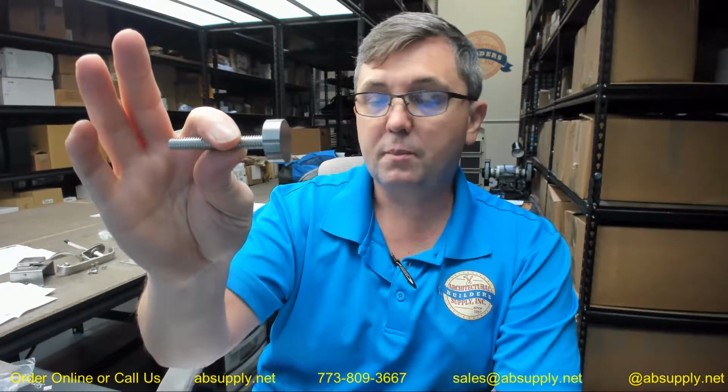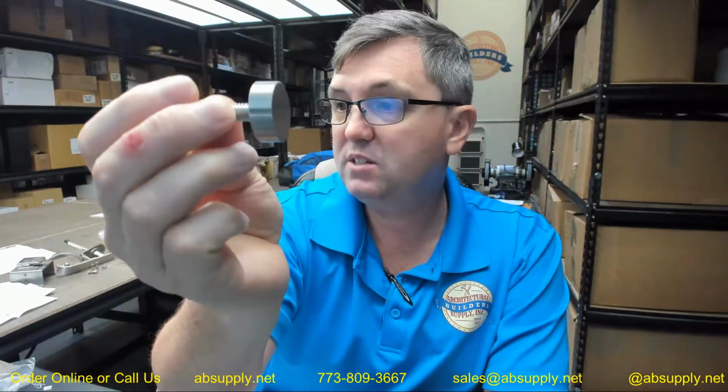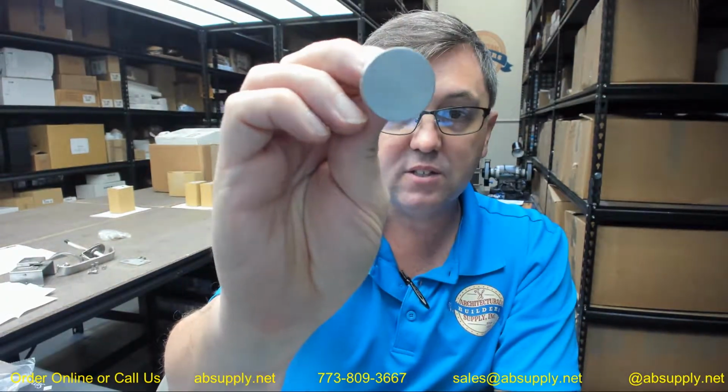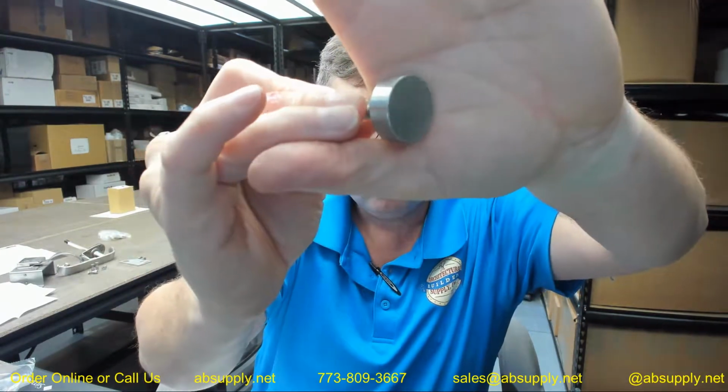mount that to the door somehow, and there's lots of different ways to mount it, both surface mounted, concealed, through bolting. Well, if you're going to through bolt it, which is always a great idea, you have a couple of options. You have the decorative style, which is the SP1055, which will give you a piece of architectural metal, in this case brass, with a finish on it. This is 626, so it's going to be a piece of solid brass with a satin chrome plating over it,